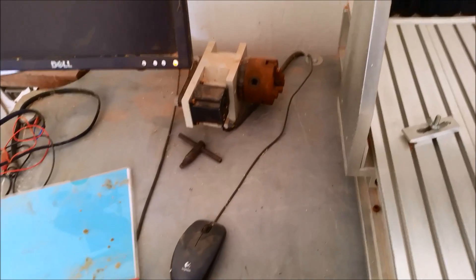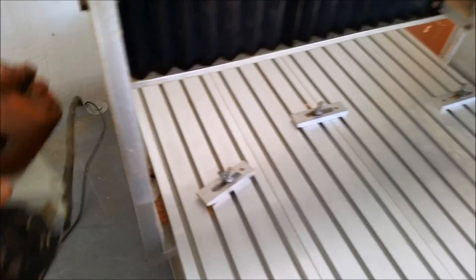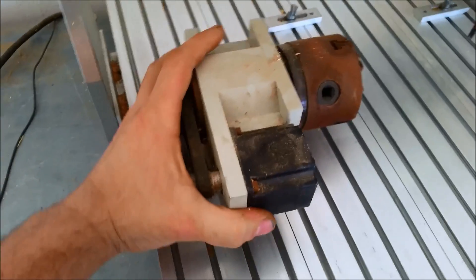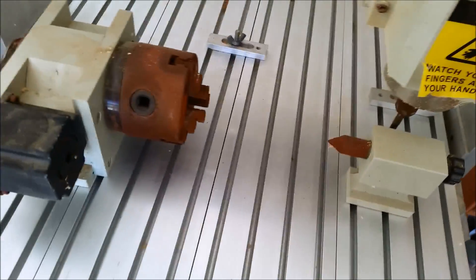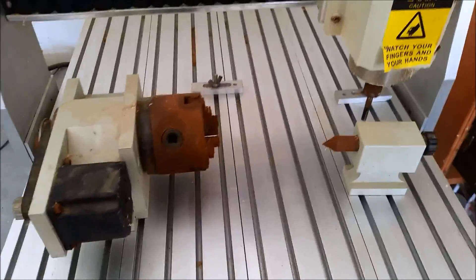I have yet to actually get really good cuts on it. I don't know if it's my timing, my stepper motor settings, or what. Another thing is when you go to put the fourth axis on the table, you have to place it and try to straighten it, then put in your end stop. Then you can mill your piece out. The problem is it is extraordinarily hard to get this lined up and straight.